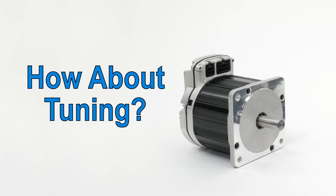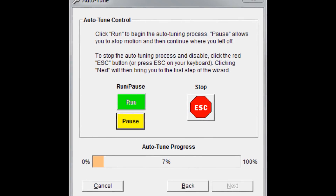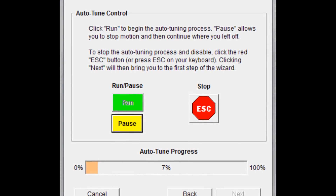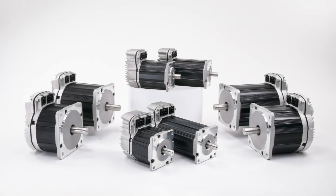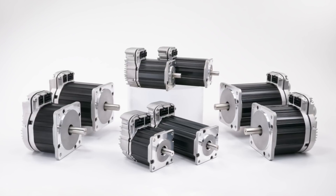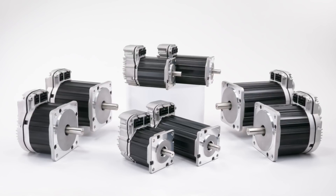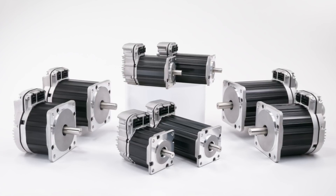One area of concern for people considering using a servo for the first time is how hard it is to tune. Well, you don't have to tune it at all — ClearPath has a sophisticated built-in auto-tuner. And if you want to fine-tune the auto-tuner's results to suit your personal preference, you can get increased disturbance rejection and stiffness at the expense of a little more audible noise by moving just one simple slider control. In summary, provided you need at least 25 to 50 watts of shaft power for your application, the ClearPath SDSK series is going to offer you an easy-to-use, fully integrated servo solution that runs smoothly and quietly without the worry of losing position, for less money than a comparable power stepper motor system.